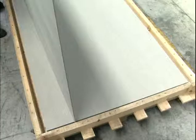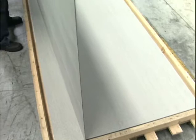Now the slab can be positioned vertically, keeping it always straight. When the slab is vertical, lift it, supporting it from the upper edge, then transport it, keeping it always vertical.